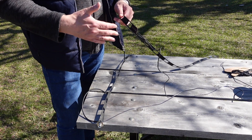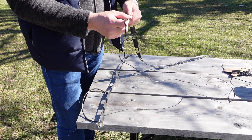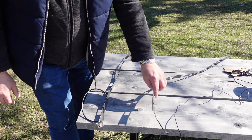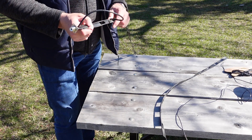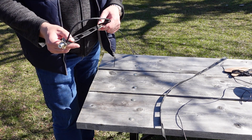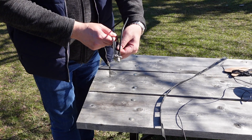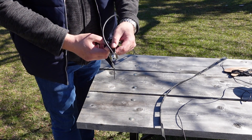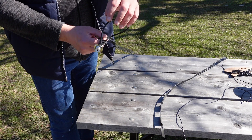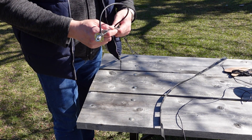You need to experiment a little bit. I would start with a velocity factor of about 0.9. For this cable, I think it's like 0.89 or 0.88. I took the feed point dimensions from the internet — there are great resources if you do your research. This distance is about 2.5 centimeters. The interesting part is I have a connector here. I've seen people put a choke right here — I didn't have a ferrite I could use — but they attach the choke so they can later connect the cable without worrying about it.